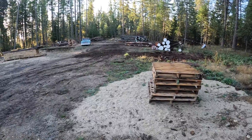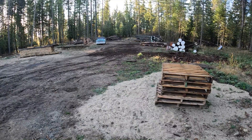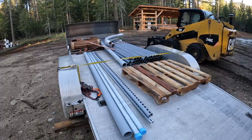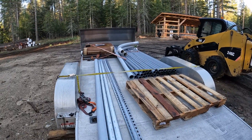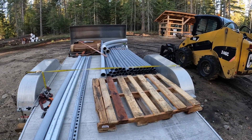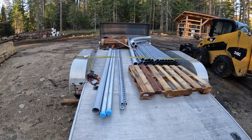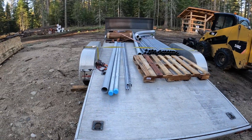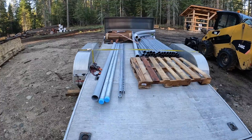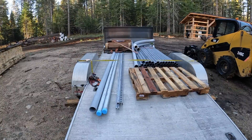The power is up through this road and to the front of our property. It comes across, but we'll have to do about 400 feet of trenching, and then we're going to install the pipe for that. This is kind of the big supplies there — the meter is in that cardboard box. We have 400 feet of two-inch schedule 40, then three-inch for between the meter and the transformer, some heavy two-inch metal pipe, some unistrut brackets in a couple different sizes, and two copper ground rods.